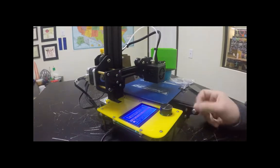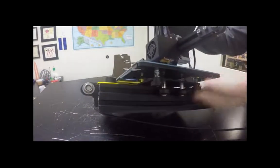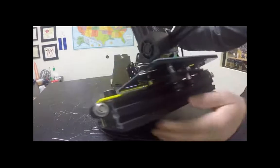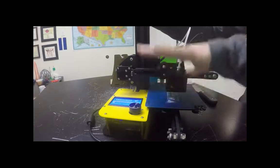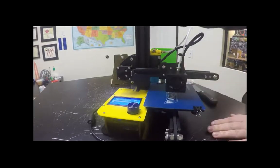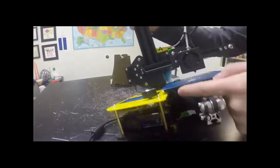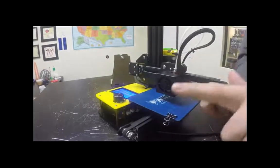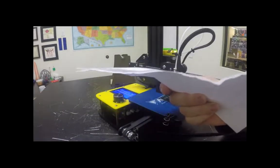The next thing is probably the hardest part of 3D printing with the machine itself — making sure the build plate is level. Go ahead and plug it in. One of the things that helps this printer is the reliability of fewer bells and whistles means fewer things go wrong. Students will be able to level the printer on their own, all manually using the knobs at the bottom. Leave yours flat on the table so the Z axis doesn't move, because if it moves up and down that will give you an inaccurate level.